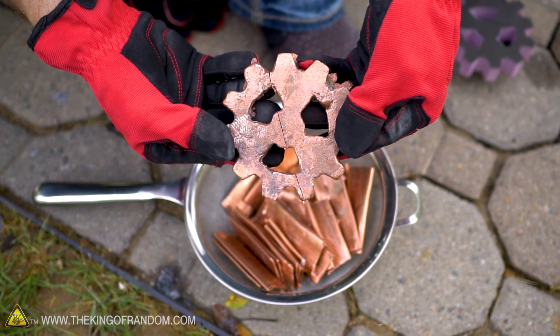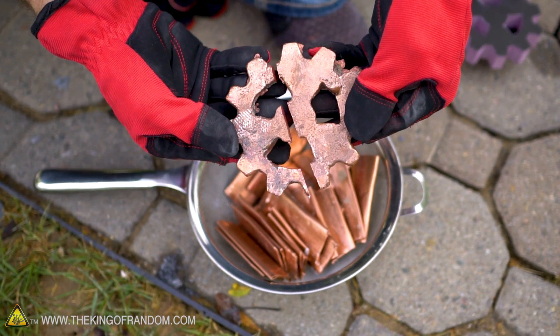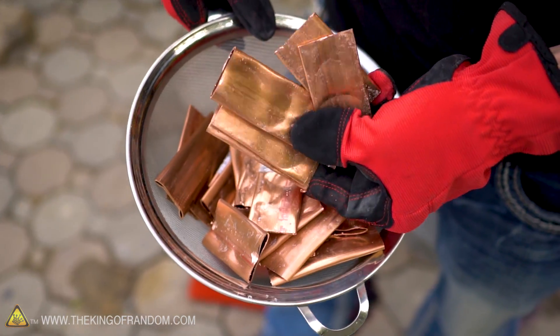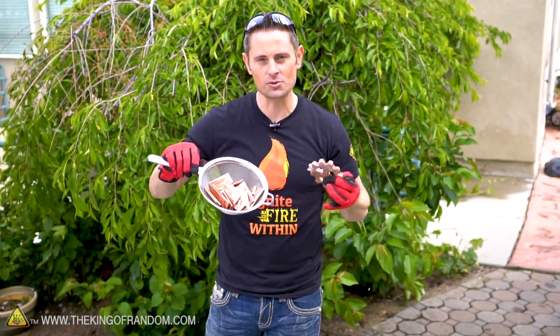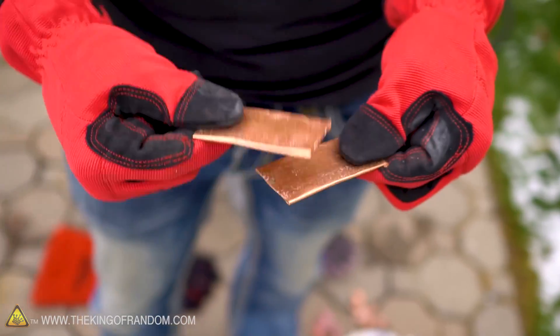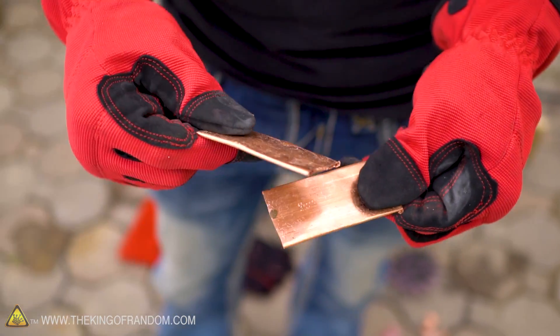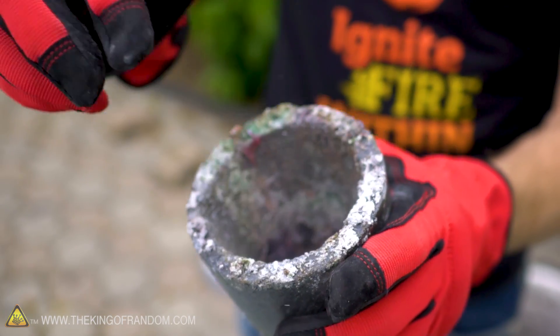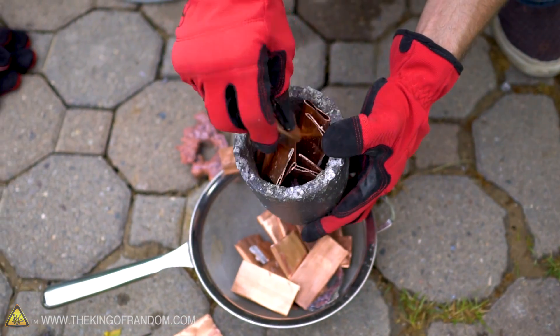I just took my copper gear that I'm not extremely proud of and I cut it in half so that we can remelt it. I also made a trip down to the hardware store and got another $30 of copper tubing, and this time we just cut it and smashed it flat so we can cram more of it into the crucible. Believe it or not, this little bit of metal here — you're looking at about $60 of copper. I also have a little copper nugget left over from yesterday's casting, so I'm going to throw that back in, load this crucible up with copper, and then prep our sand casting mold for another round.